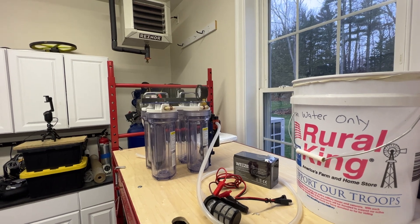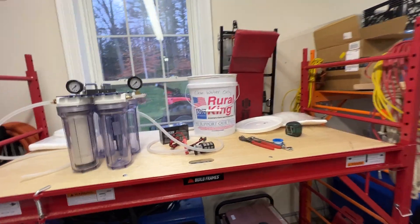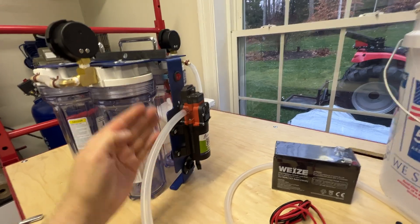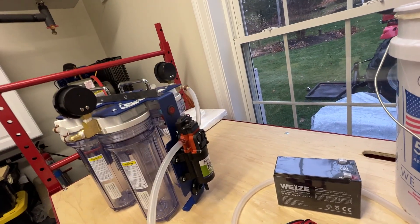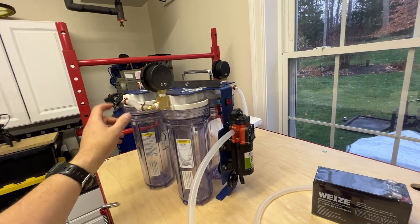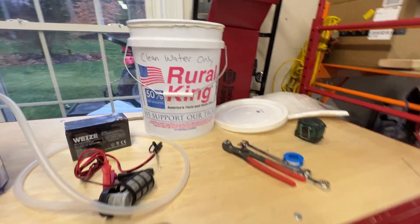You can check out the affiliate link in the description below. You could also probably build one of these — I've thought about building one with a higher-pressure motor, though you'll end up spending about the same as buying one. If you're a handy person, it isn't extremely difficult: you basically need a pump, a switch, a power inlet, an L-shaped bracket, and the parts to plumb it together. I've upgraded the hose to silicone food-grade hose so it doesn't kink as easily as PVC vinyl, and I also updated the elbows to brass fittings for a little more robustness.